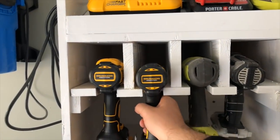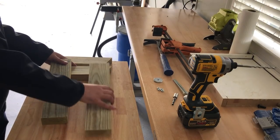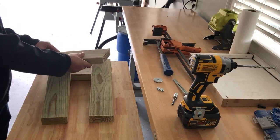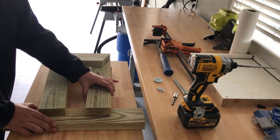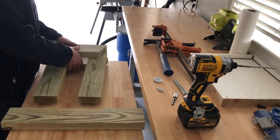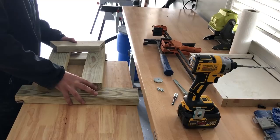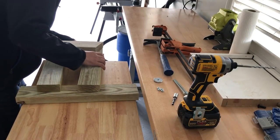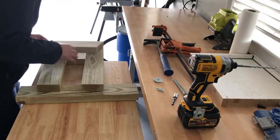Grab the drill and the 5/16 inch drill bit and let's get started on the legs. Now to do the legs, we're going to need 2 16 29/32 inch and 2 11 21/32 inch boards at 65.5 degrees, and we're going to sandwich these together like so. Then we're going to drill the 5/16 inch drill bit through the middle and secure the legs with bolts and nuts.